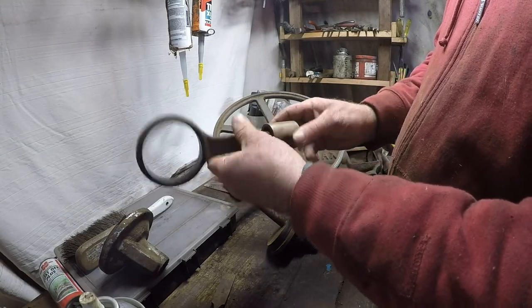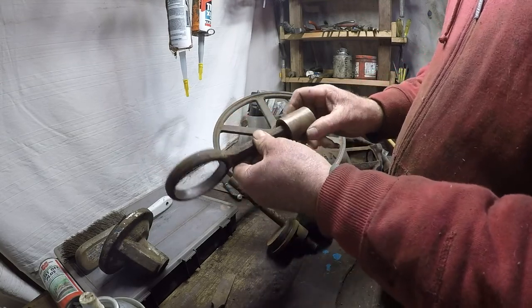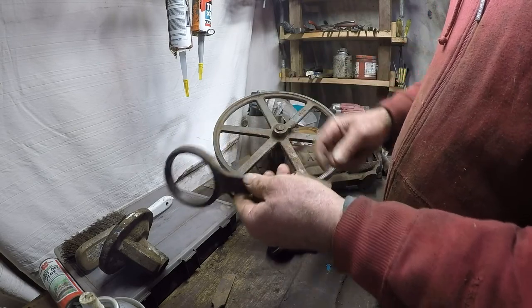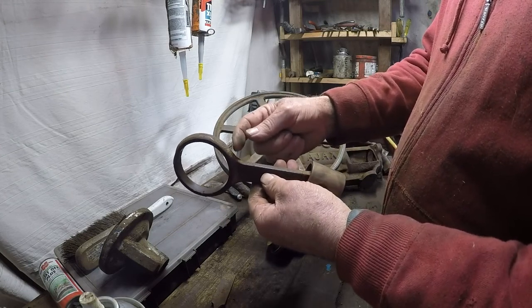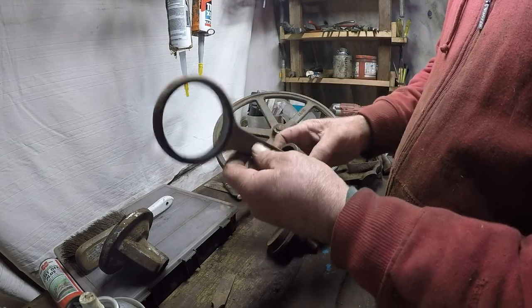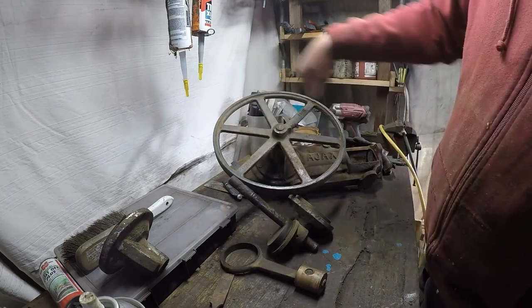This one's not too bad but it's got a little bit of slack — you can see you can move it like that. The oil's not really getting carried along there, so if you've got a little milling cutter or even just a tiny wheel on an angle grinder and you do a little trench that leads up to that hole, I think it'll make your pump last a hell of a lot longer. But yeah — clockwise.